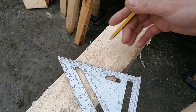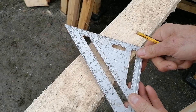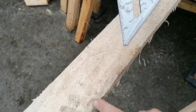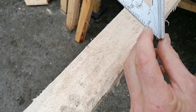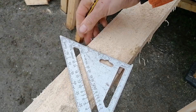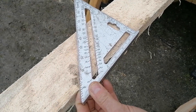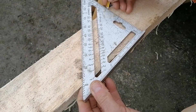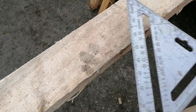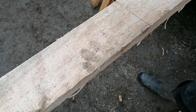So here's my roofing square. I need a six degree angle, so I'm going to swing it around, sit this point on the edge of the rafter, and swing it around until this edge lines up with that mark. This is one, two, three, four, five, six degrees. Line it up with that mark at 1,935 — put that line through there.